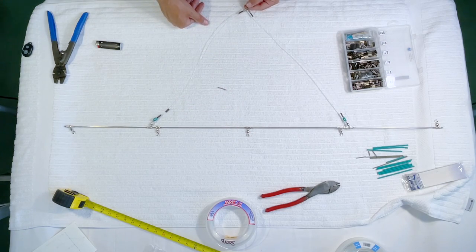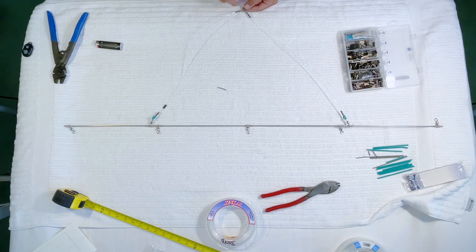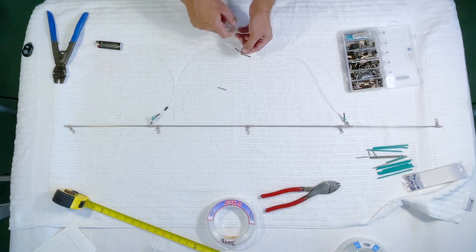Now how I'm going to rig this main line is different than a lot of the rigs that I've seen, but I think that it's great. One reason why I really wanted to put the sleeve protectors up here and I didn't really care about there is there's going to be three here in a row. And I figured, if there's three in a row banging around over time, what if sand gets on it or whatever, I don't want them to get beat up. So that's why I put these stainless ones right here.